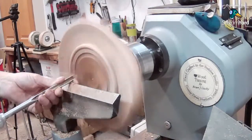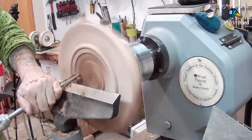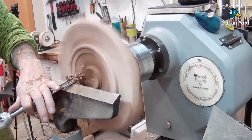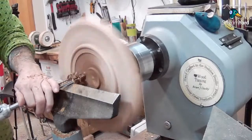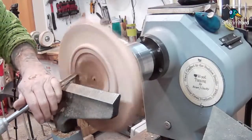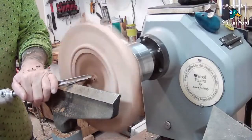And as you rotate your tool over and start to head towards the middle, you actually need to slow down the speed of your cut. So the speed of advance of the tool has to be slower. I took too much cut there, so I'll go back out and up in an arc towards 12 o'clock, and then head back down to the centre and finish on the left wing, just about there.